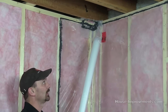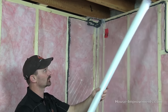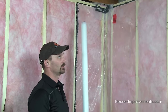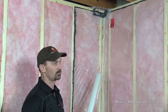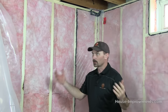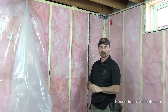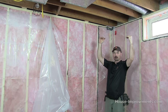We do have some videos showing a few different ways to insulate and seal these box joists, as they are a little bit difficult to do. They can be done with poly, they can be done with spray foam, and they can also be done with a combination of batt insulation and 2-inch rigid foam sealed with canned spray foam. We're just dealing with a normal flat wall here. We're in a basement so we're not doing the ceiling, but if you were on your main floor, much of this pertains to exactly the same thing — you would also be doing the same process up on the ceiling as well.